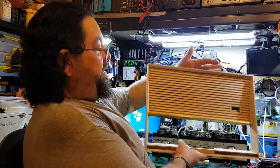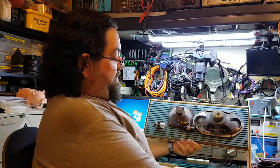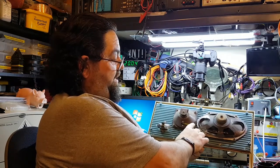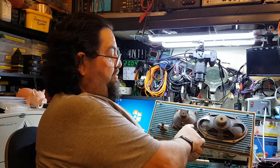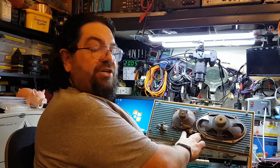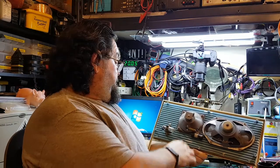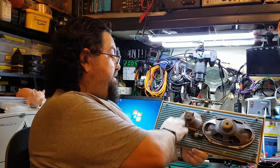I've cleaned up the front panel, though I don't know how the lights are going to pick this up. I've replaced this capacitor here with this one — it's a two microfarad capacitor, and so is the replacement. When I checked the old one on the meter it was actually reading nearly six microfarads, so it was three times the original value.